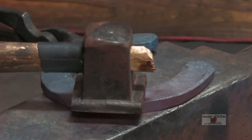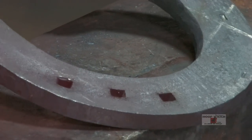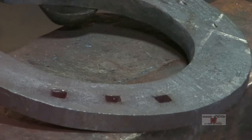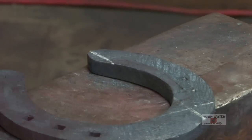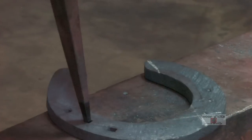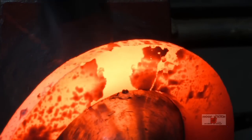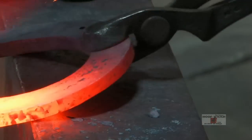We'll flatten it. You almost feel like you got a trough in the center — that's what you've got to be careful of, because when you narrow it up too quick the center doesn't expand and then you've got a ditch in there and we're trying to get that out the whole time we're working. I'm going to start where my toenail is and start forging down and just sweetening up the inside a little bit. I'm going to lean my hammer right here and get that saving, and that gets that little junk off the end so it doesn't just make a point.